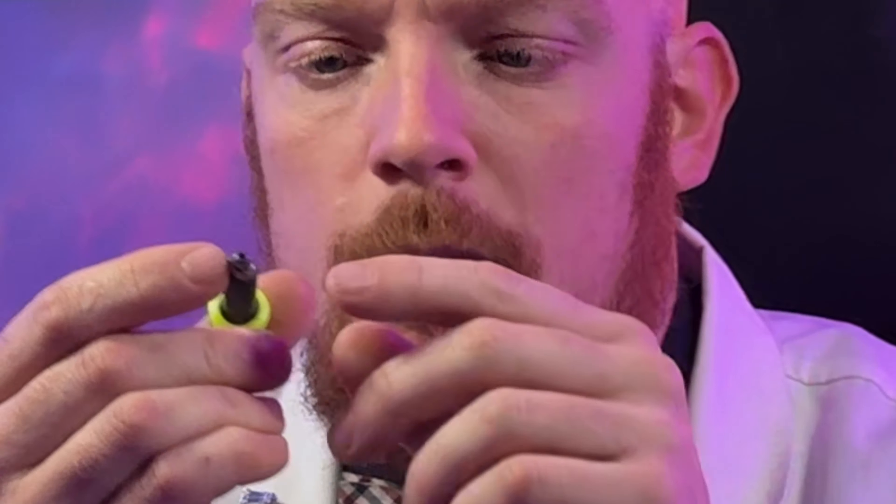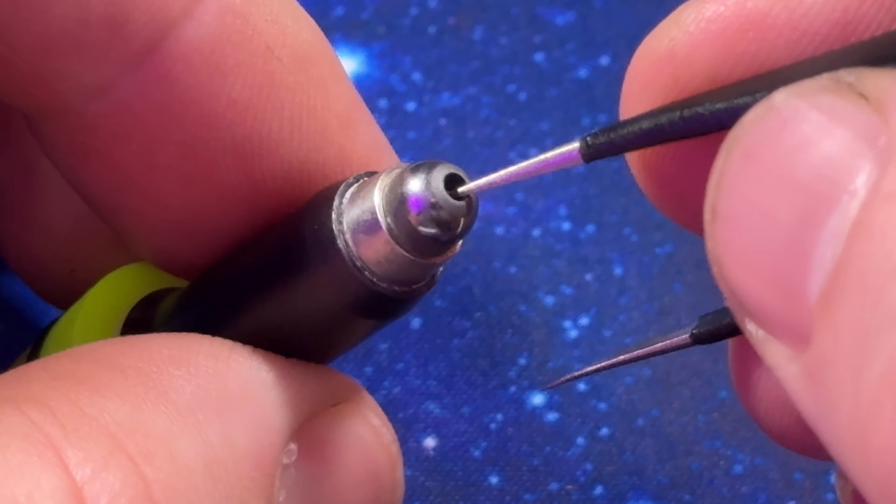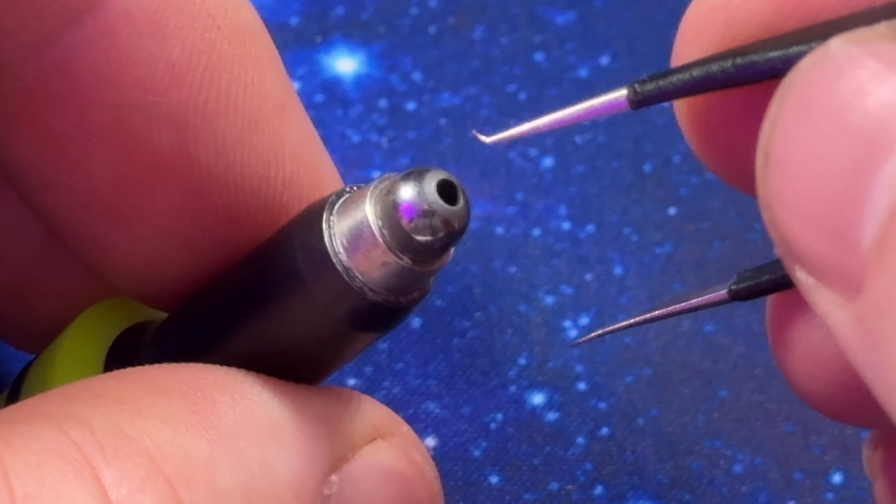One thing I want to touch on here is this little carbide on the end. This little hole is known as the orifice hole — this is a number 10 tip, so this is a number 10 size orifice hole. A 12 would be a little bit bigger, a 4 would be smaller. What's really interesting is that typically on a normal Hydrovac nozzle, the entirety of this bubble is completely hollowed out. Whereas with the Dig Pig Silencer, you can see it's completely straight, meaning this carbide is stronger than any in the industry, period. The bubble being made solid all the way through — it's stronger, way stronger, and it's going to last you a lot longer.